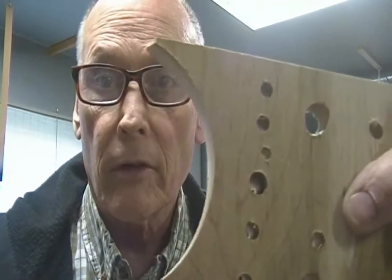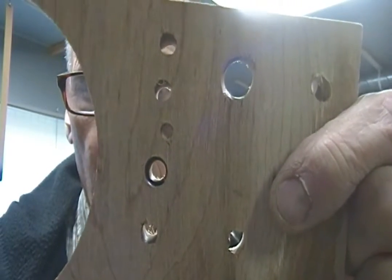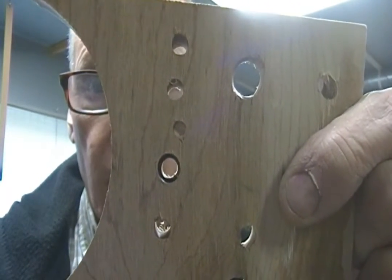So I just wanted to share that really quick little tip with you — that you can grind the end off and make your own step bit. I didn't even have to go to any extra trouble. If it had not been centered, I might have had to fiddle with it a bit. But as you can see, it didn't chip either. So there you go — make your own step bit. Thanks for watching, you guys have a great day.